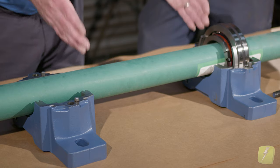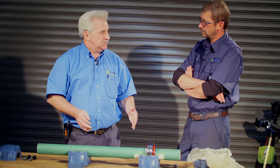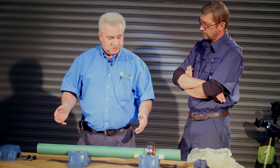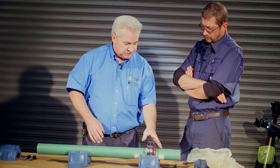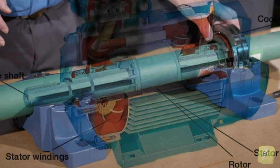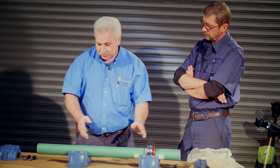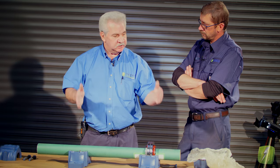So a twenty-inch shaft is pretty much twenty thousandths until you start plugging in hotter values. It's a good practice to get into. Hopefully it makes sense — on a motor, clamping the opposite drive end and having it grow towards the shaft extension, you should be able to calculate the distance between the bearings.